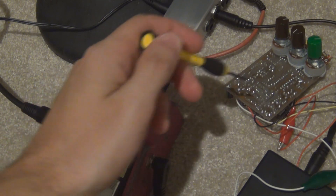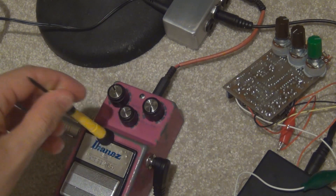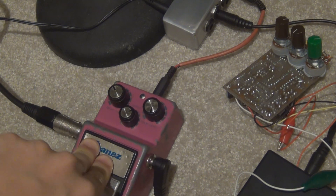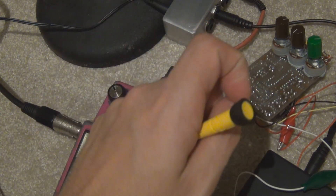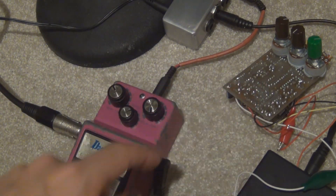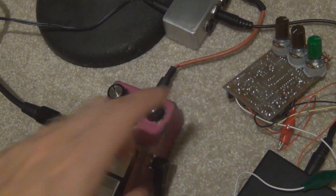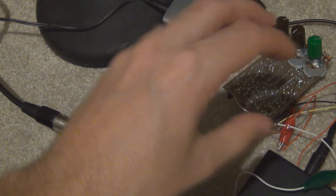Also, you may notice a bit of noise in this pedal in the repeats. I think the difference between the two is that the AD9 is heavily filtered — that's why it sounds so warm or dark — because a lot of the top end of your guitar signal has been chopped off. This helps to get rid of the clock frequency so that you can extend the delay time longer without hearing the clock frequencies creep in. Whereas this one doesn't have as much treble filtering, so you can't take it as far. Having them both set to the same delay time is actually a disadvantage for the DM2, because it reproduces your guitar signal a bit more clearly than the AD9 does — it keeps more of the treble in the guitar content that's repeated on the delays.